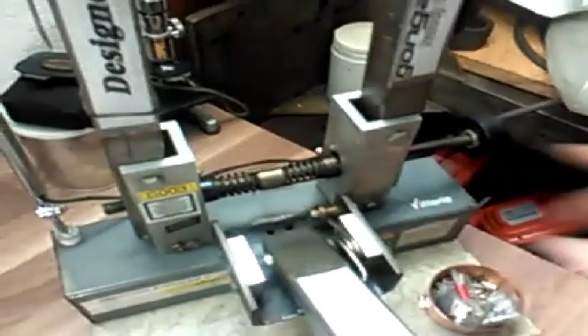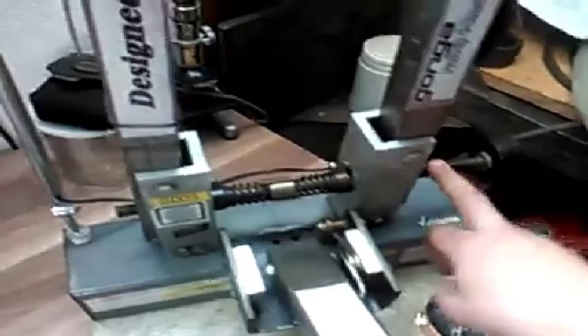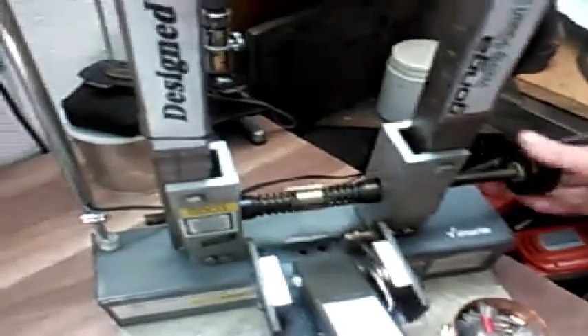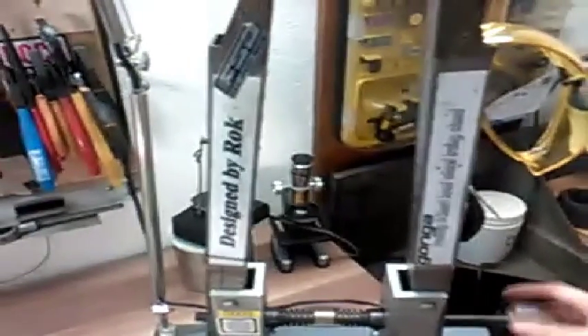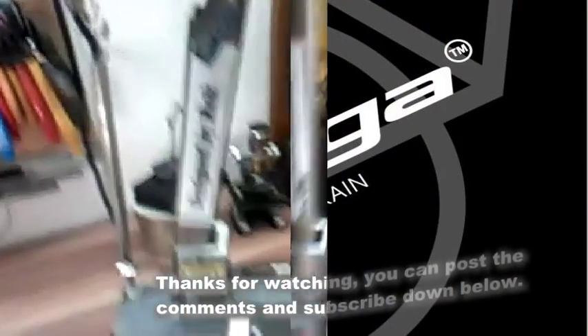The only problem was probably cutting the thread — on this side it needs to be left-handed and on this side it needs to be right-handed. That means when you're turning this, both arms need to move simultaneously together and backwards as well.